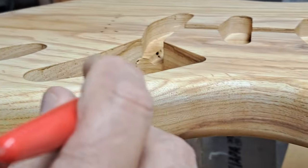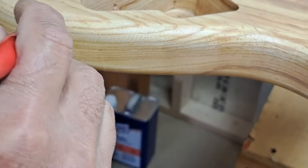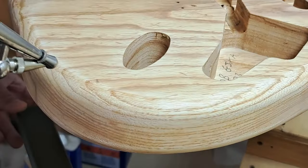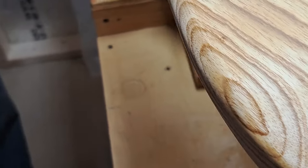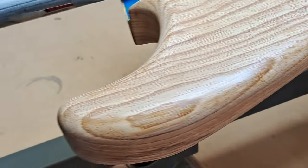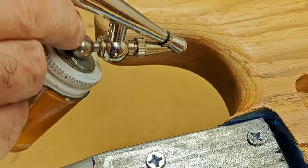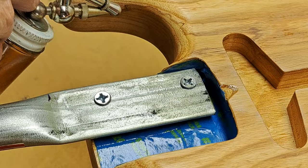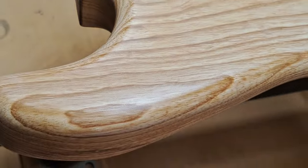Here I care about the shellac barrier. This is like a foggy finish that hasn't changed the texture at all of that last sanded with 400. The two things I'm doing are coloring in the lighter areas and putting my barrier back, which is more important than color. Coloring in the areas right here doesn't mean anything because there's a brown sunburst there, but I want that shellac barrier back. It doesn't take much — shellac is so sticky and digs into the wood so hard, that's all I needed right there.